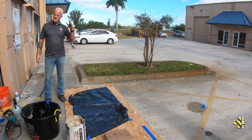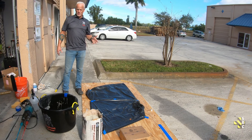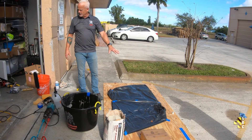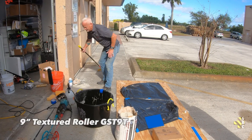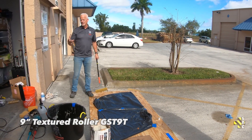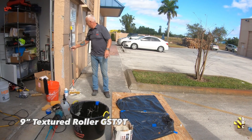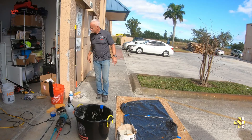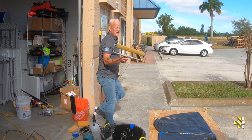What we're going to do here is show you how fast it goes with a reasonably warm day in the direct sun. Once I place this and roll it out with my loop roller and get it to the height that I want, I'm going to wait a little bit and then put a smooth finish on half of it with the magic trowel. We're doing large overlays like the job that you guys are about to supply for.